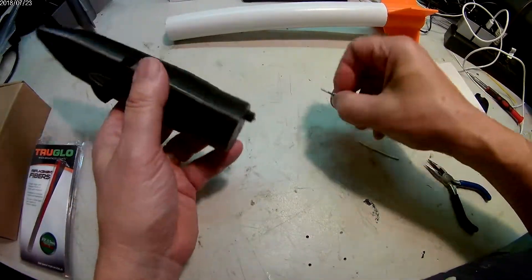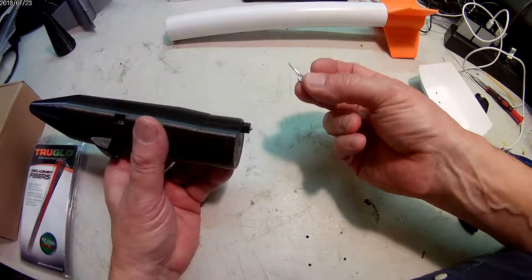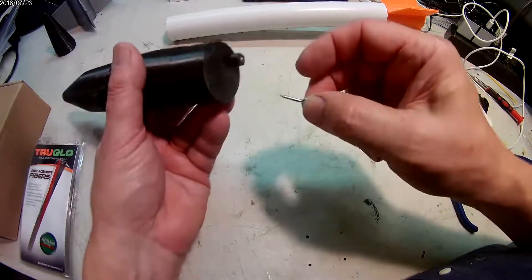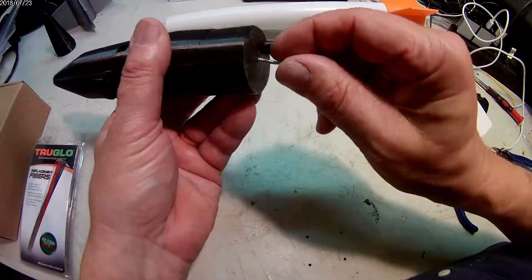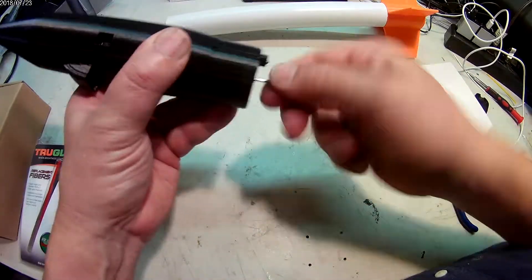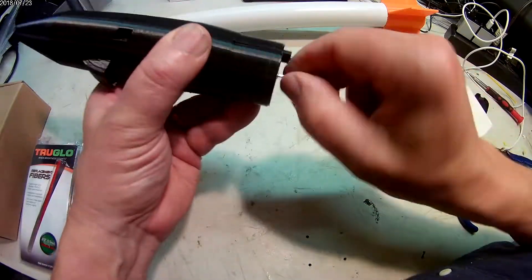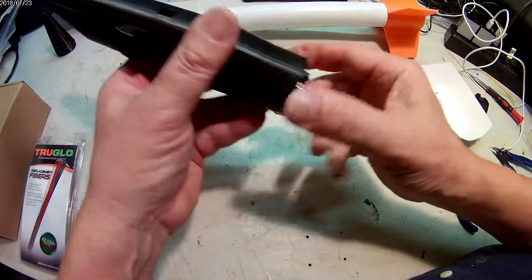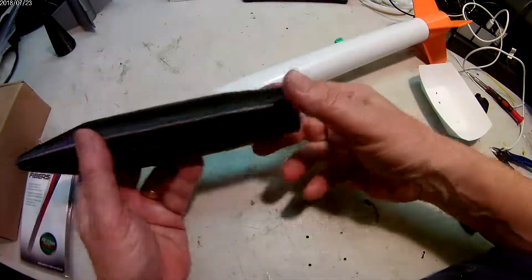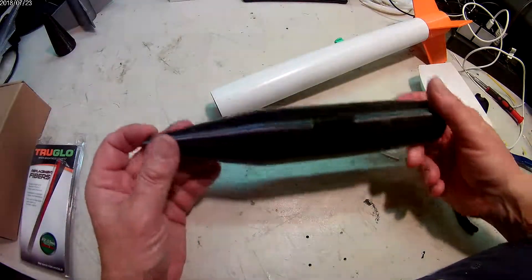And if you want to recover the camera and the body together, you can take a little screw eye — depending on the screw eye size you use, you might need to heat the tip up in order to fit it in. But there's a little opening at the bottom here and you can just screw it in. Now you can attach the booster to the base of the camera using a shock cord, and then a parachute that's on a shroud line that comes off the nose cone.